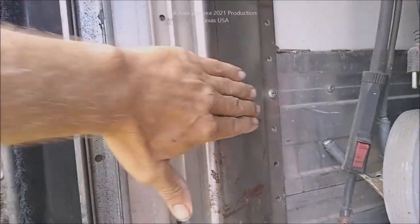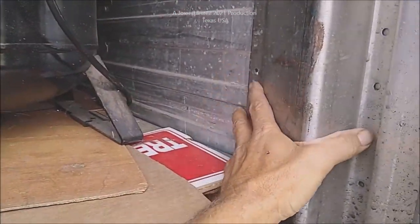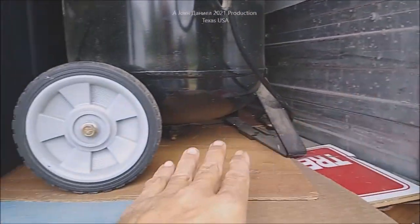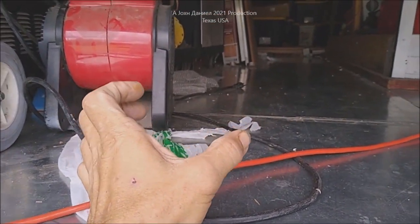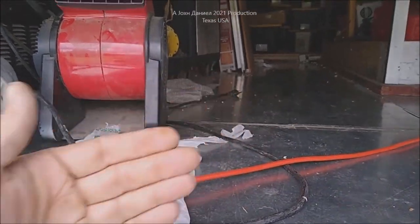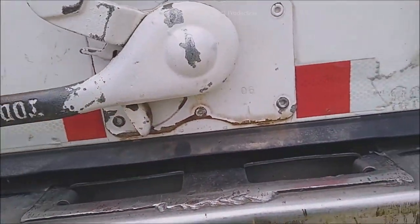These screws here are on a pallet jack bumper that prevents you from damaging your door frame when hauling out. The second thing is these trailers are 8 foot 3 inches wide. Those cargo containers are 8 foot OD outside diameter, but they're metric. This trailer is designed for US pallets — four foot wide — so if a pallet shifts a little, you still have movement space. Two four-foot pallets with a little room means they don't get stuck together and you can get them out.